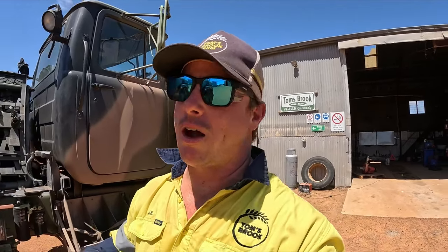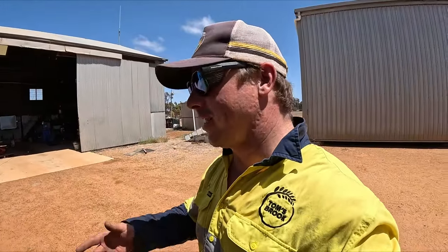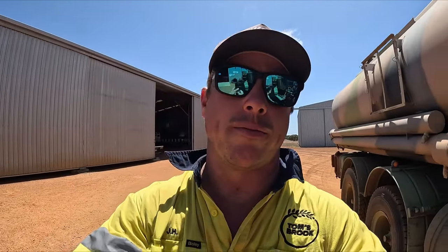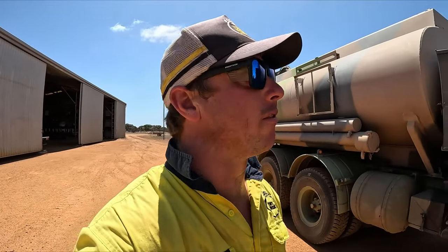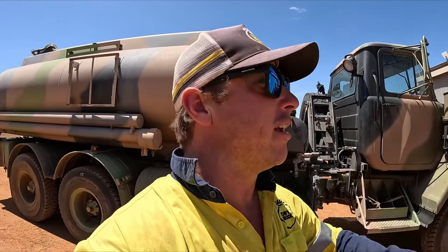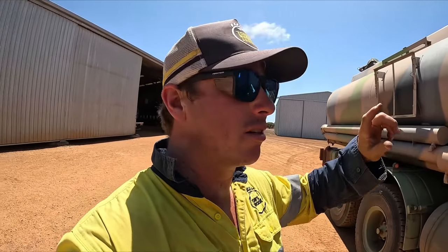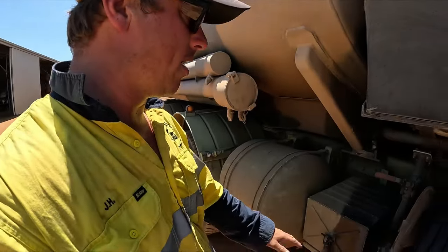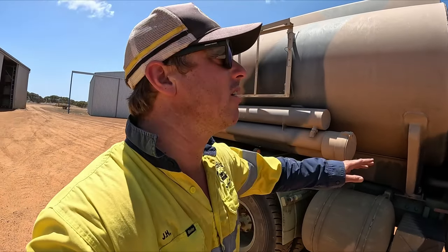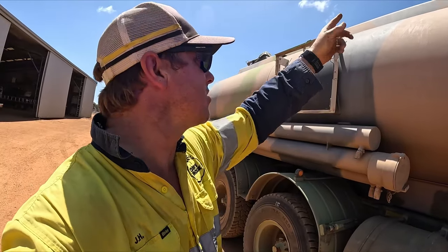I was saying before about how we're going to sort out the air issue because this will most likely drain its air over time. It had been sitting on the back of that truck for two weeks and it had drained its air. Two things I need to do: one, I'm going to put a solar panel on the roof. I actually have a ridiculously large solar panel from a solar pump up in the shed that puts out a max of 33 volts. I'm thinking I might use that and use the battery converters to bring it down to 24 volts and put it into our batteries.